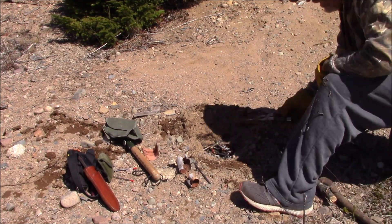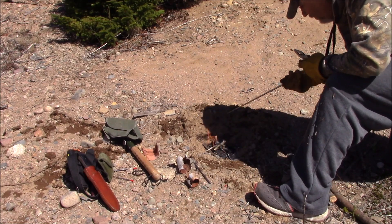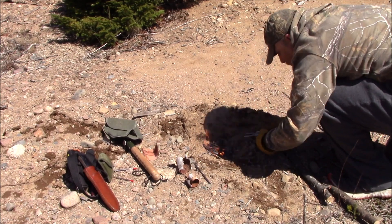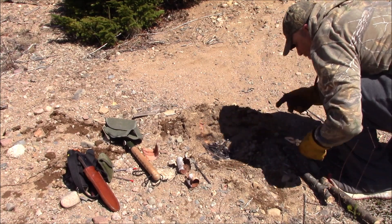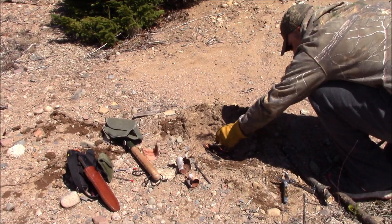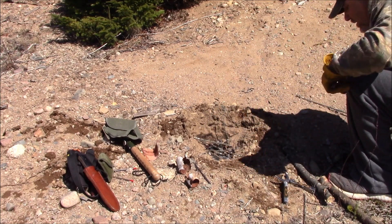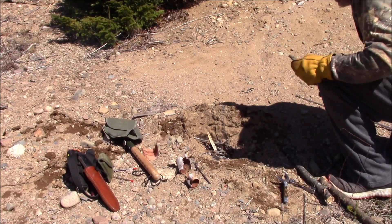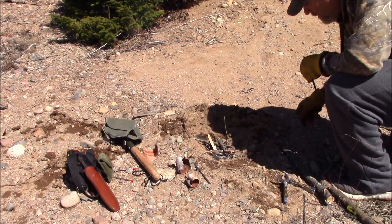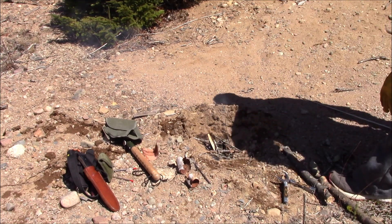It's not hot enough okay — it's getting hot though, but I'm just trying to heat up just that tip. Drop it back in there. We can tell how hot it's getting just by the color. And I do not want the colors to reach up to that end of the blade — I may actually cool it off at the end with a little water. I'm keeping an eye on those colors as it goes up through. If it does, then I know that I have to cool it off.